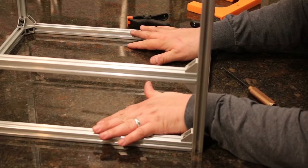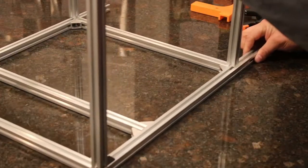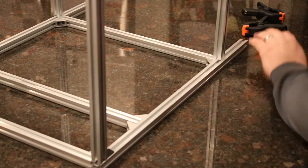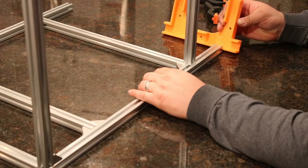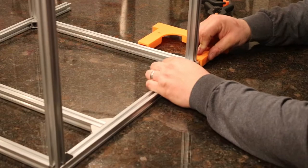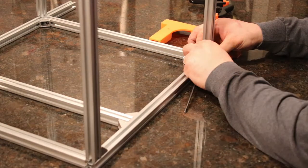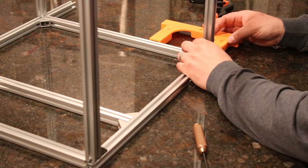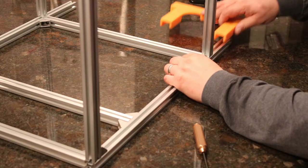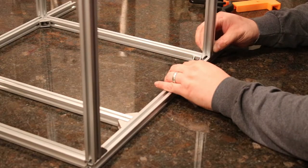At this point, we've placed all the corner brackets and pieces needed for the actual top of the frame. Rotate the frame on its side and make the last two connections to ensure the alignment of everything is correct. Take your tool and place it so it's in this orientation pushing against the very bottom of the leg — that's going to ensure everything's held nice and straight. In order to get this mounted properly, this surface has to be against a flat surface, because it was moving.